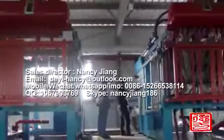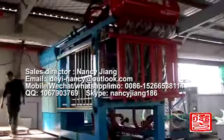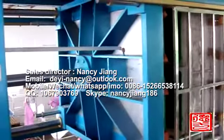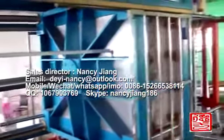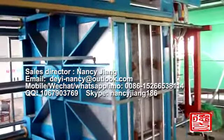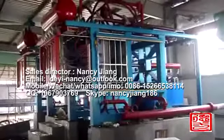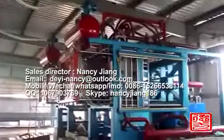The formed material will be sent to the material barrel of the foaming machine through a blower. The automatic foaming machine can set material feeding time, steam pressure and foaming time. The material will be sent to the mold, fed by the material barrel automatically. When the foaming time is reached, the product will be pushed out by the charging ram, finishing one process cycle. The finished product will be put in the drying room, then stored and sold.